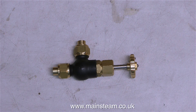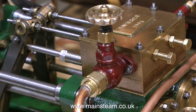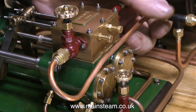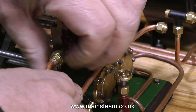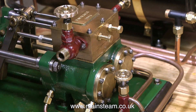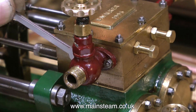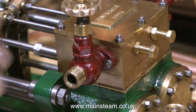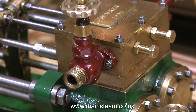The reason for going to Black Gates Engineering in the first place was to buy this — a 90 degree globe valve — to replace the existing one. That existing one is a 180 degree valve, it's in the wrong position, and it leaks. The steam pipe I made in the last episode to connect the steam supply to the pump was only a temporary measure and can now be discarded. Before I make a new pipe, I have to modify this valve, and using one of my new spanners, I'm removing it from the valve chest.